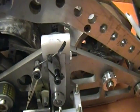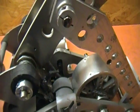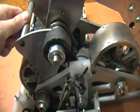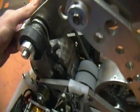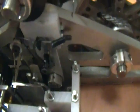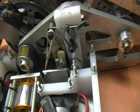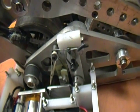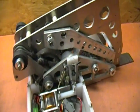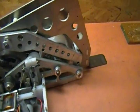After it releases, the spinning flywheel winds in the coil drum just like in previous versions, and that winding pulls the rope so the flipping arm goes through its stroke. When it gets to the end, this big rubber stopper hits the white part on top of the clutch and thumps it back down where the latches catch it, and then the arm rotates back and the flywheel is free to move again.